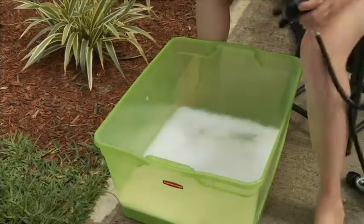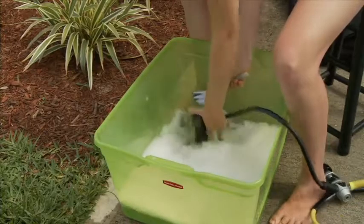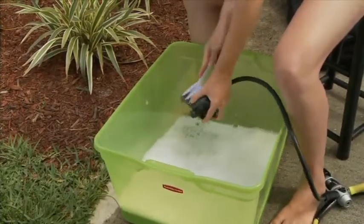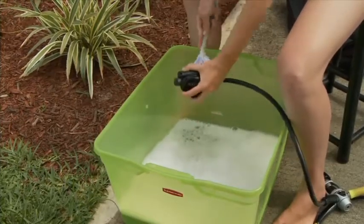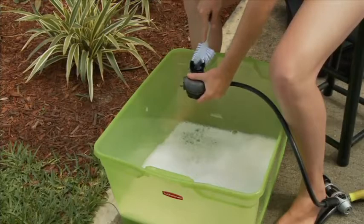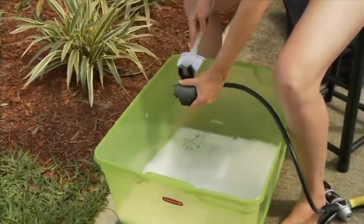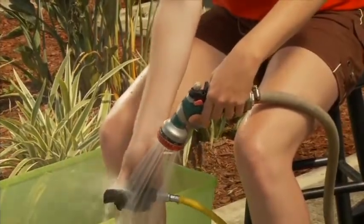To begin cleaning and sanitizing regulators, you should use a scrub brush and wash a regulator thoroughly with a brush and appropriate detergent solution. This detergent should not contain any hydrocarbons. Remove any dirt, sand, saliva, or seaweed from the gear. Then, rinse it thoroughly with fresh water.